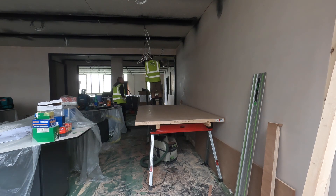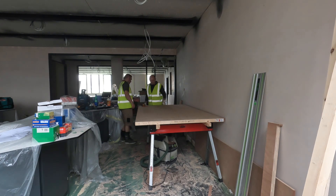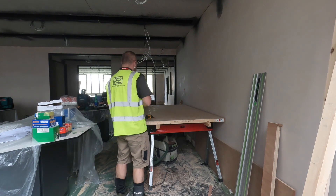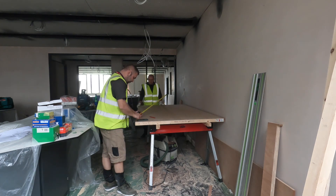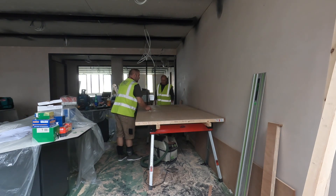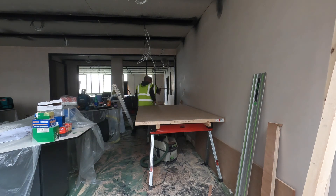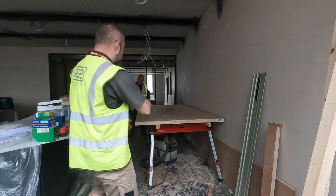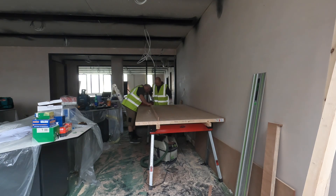After installing the lipping on one side, I turn the door the other way around and take measurements — top, middle, and bottom. Before transferring them to the door, I deduct nine millimeters from the total. So if the door width is, say, 750mm, I deduct nine millimeters and I'm left with 741mm. The standard gap for fire doors is between two and four millimeters between the door and the door frame. We're leaving nine millimeters now, so we'll have four and a half on each side, allowing half a millimeter on either side for painting.